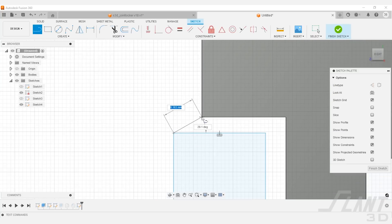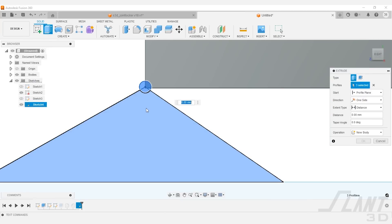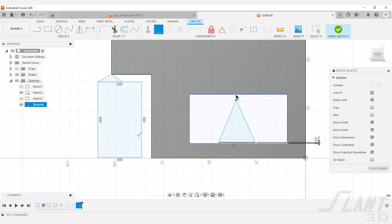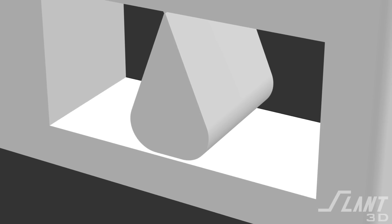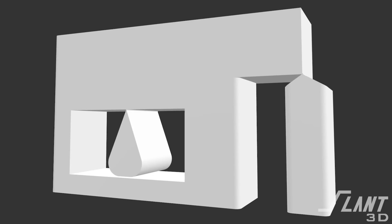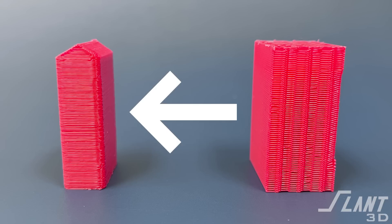One situation is using designed supports. With designed supports, they're basically just a small block printed completely hollow that comes up to a point wherever it needs to be supported. This is a great solution for these types of parts — not only is it well supported with minimal material, but it breaks off exceptionally easily. For the center support on this part, you want to make them kind of a teardrop shape, because since they interface with the lower part of the part, there's a lot of friction there, and a rounded lower surface is ideal. Just slightly rounded — not too much — because it has to be built reliably and you don't want an unstable, teetering piece of print. It's very easy to make this sort of designed support so you have a reliable part with all the critical features, without wasting large blocks of material. Instead it uses very minimal amounts of material to support the area.